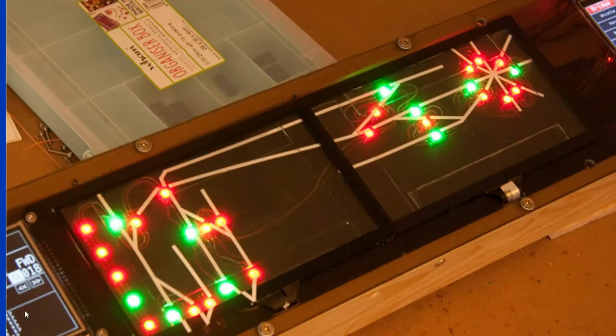The first thing I'd done wrong: I put the loco control on the left, and I'm right-handed — I basically built a left-handed controller. If you want a right-handed controller you need the loco control on the right-hand side, because your dominant hand is better at controlling the fine movements of loco speed while your left hand can just press the buttons. The lessons you learn when you build these things.